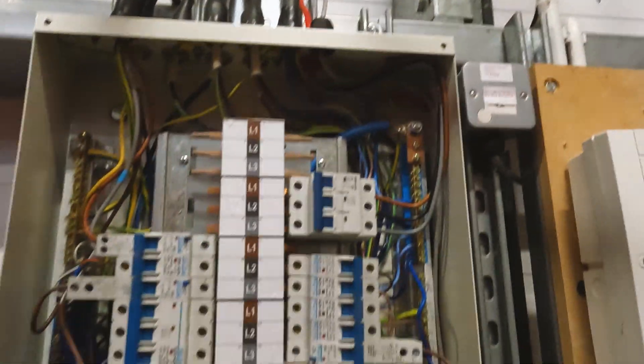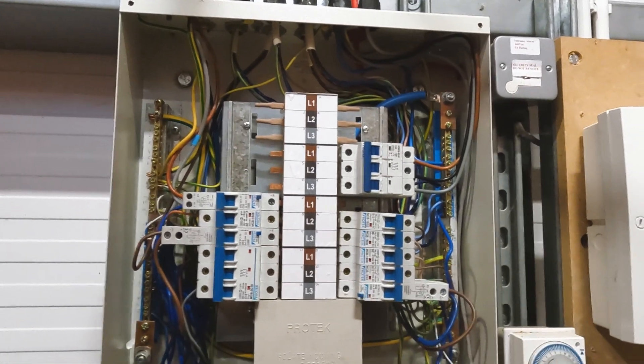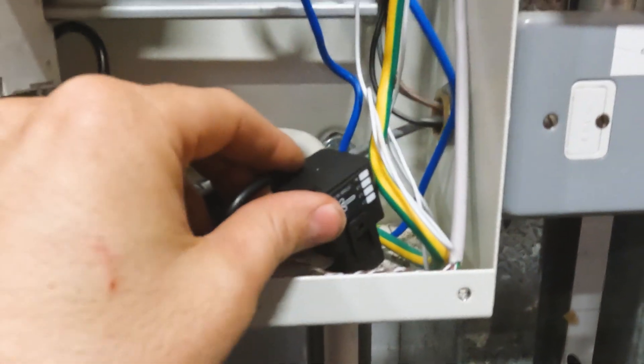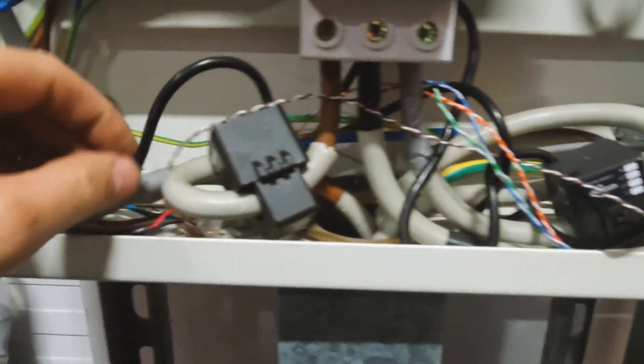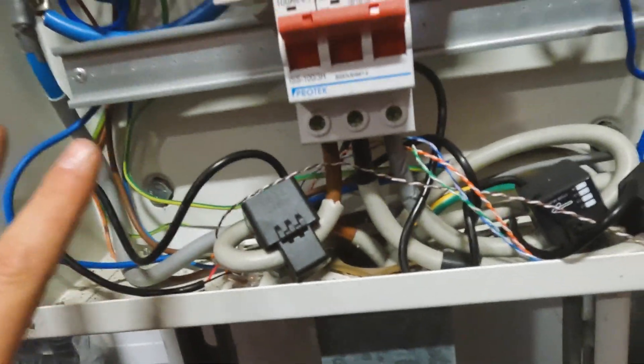When we set up the Zappi, we'll have to set CT1 to L1, CT2 to L2, and CT3 to L3. So we've got CT1, CT2, CT3 cables in - it's all gunged up now. Everything's got a nice casing of silicone around it just to stop any water ingress. We've got three screws gunged up, and then we've got to gunge the hole from the other side. We've got the cable glanded in the top, the breaker powered up - L1, L2, L3, Earth and Neutral. The CTs were a bit of a nightmare but we managed to get those on for L1, L2, L3 and extended them. Now we'll get this cover back on, get it all labelled up, and then go on to the test turn.